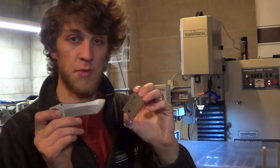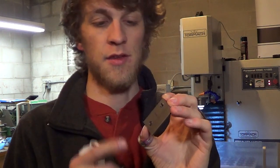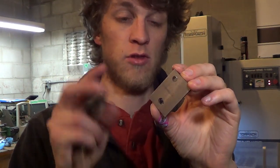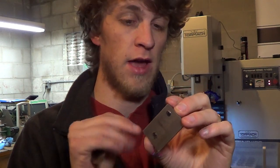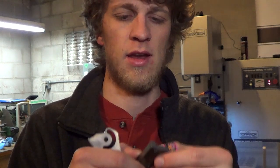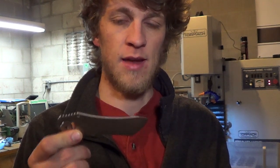Right now I'm finishing up my new clamps that I'm going to be using on the blades for hard milling. This new clamp design has two bolt locations instead of just one, so it'll hold the blade down a lot better, a lot flatter. My tolerances are better with the step size and all that, and they match the blade perfectly. With the first batch I did have a few blades slip while hard milling, and that's not fun, so let's try to avoid that this time.